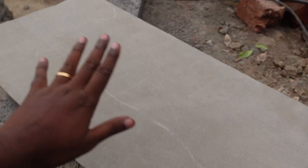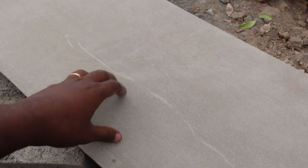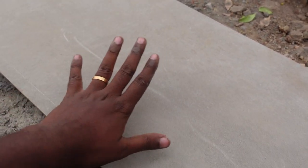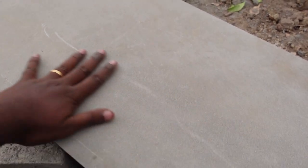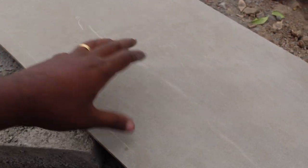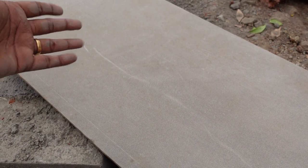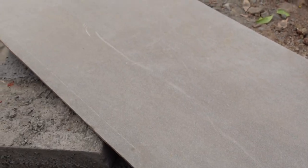While there are wood grains inside it, there are no wood grains outside, so there is no fear of them getting wet and swelling. On the outer surface, you can see it is much plainer, and there is only cement. It's only after a mm or 2 mm that there are wooden pieces. And if you're going to paint or just put a clear coat on it, then this panel can go on for a very long time. So now that we know a little bit of difference between bison panel and cement sheet, let us go and see how I used it to make the home.